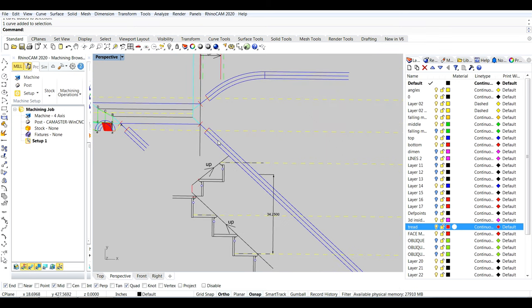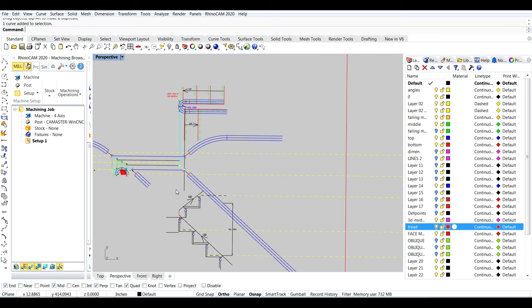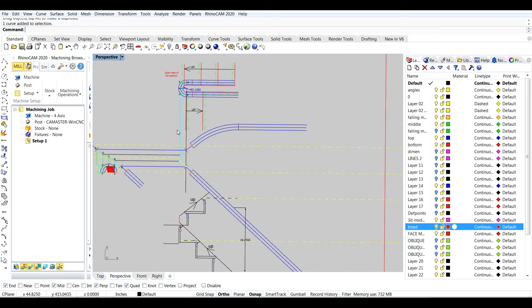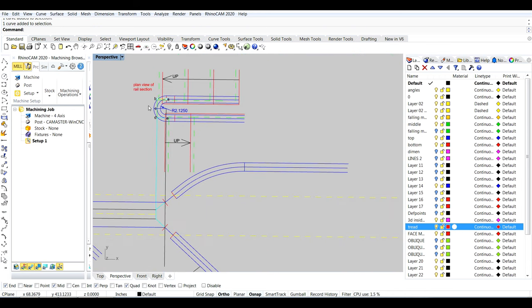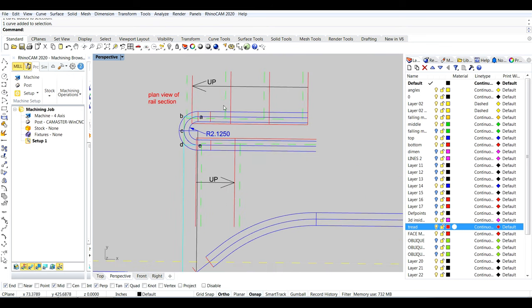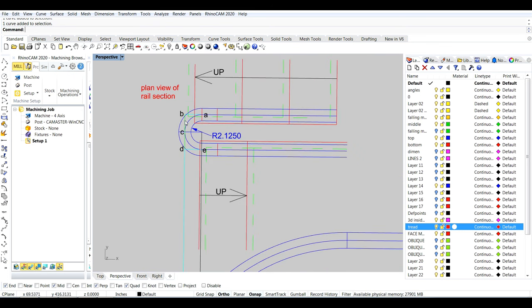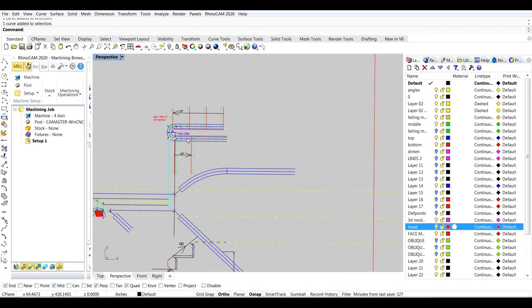You can see that I have the stairs set up with the handrail at a code-worthy pitch. You can see the pitch of the rail coming into this wreath — that pitch is going to represent this tangent right here. And the same with the upper tangent: we have the pitch of the stair elevated to code. This is the upper pitch tangent coming into the second floor.